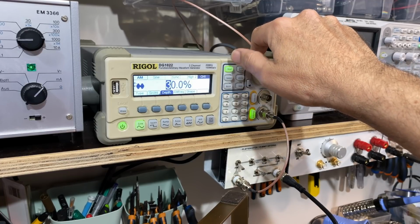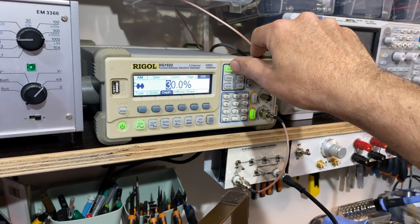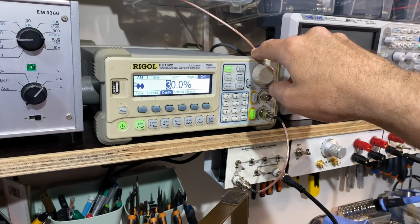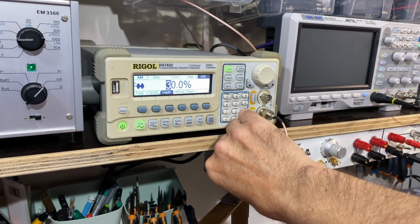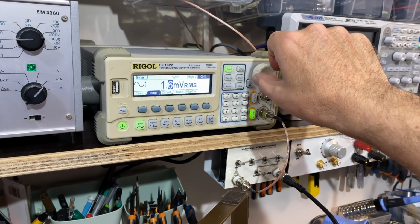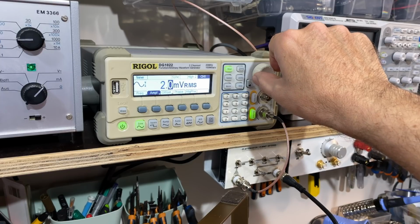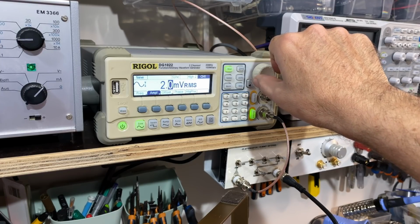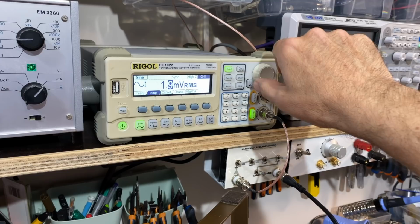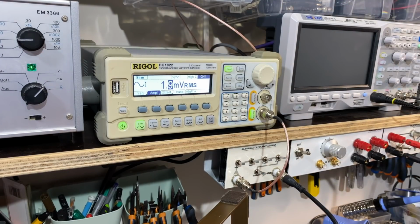And if I put in modulation, it brings that down to 6.2. And if I wanted to get 12 volts with that on, bloody hell, I'd really have to up this guy. Let's see. Suppose I could. That's 12.29, so that's 11.74. I could leave it there. 11.8. I could leave it like that. I still think it's a hell of a strong signal going in, but if we're following the instructions exactly, that's what they're telling us to do.